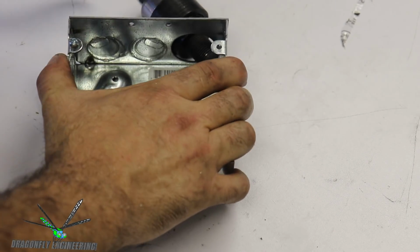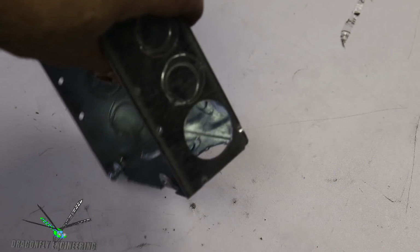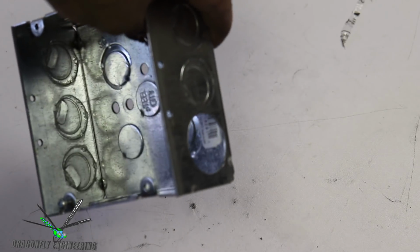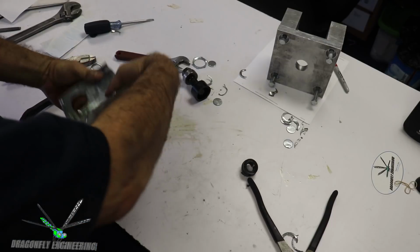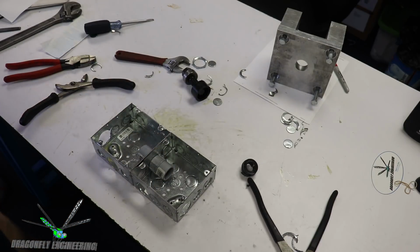And that felt like the other one broke through. Okay, and then there's our punched hole. Whoop, you see that hole there? So that will work with the 1-inch conduit coupler that we have. So I got a few more of these to do. I'm not going to run wire through here, but I'm going to run it through this protected plastic collar. I think we are ready to go back into the hellfire of the attic. So I'll meet you back up there.